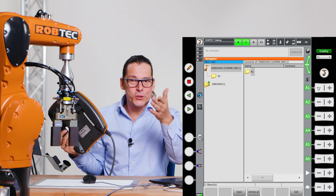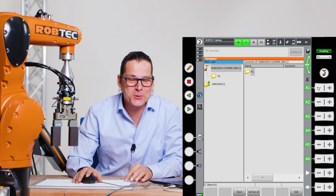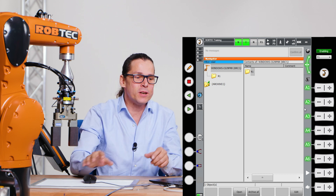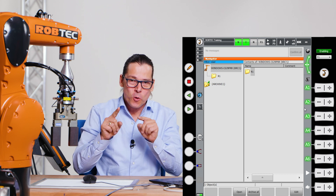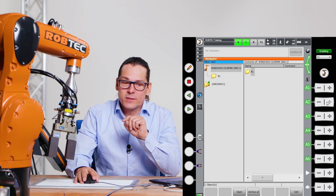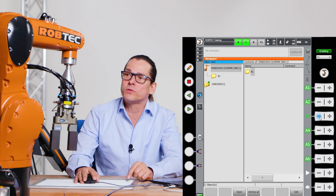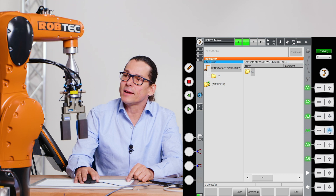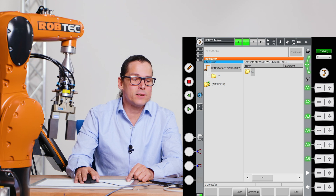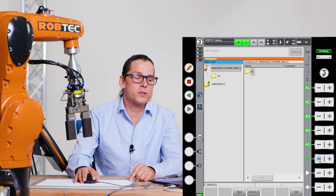It's just so you can see better what I'm doing — the screen is not ideal for recording but here you have it in high quality. What I push with my mouse is the same as what you do with your fingers on the teach pendant at home. So I can move axis two, which is the second axis, axis three which moves the whole arm, axis four the first hand axis, axis five, and axis six which rotates just the gripper.